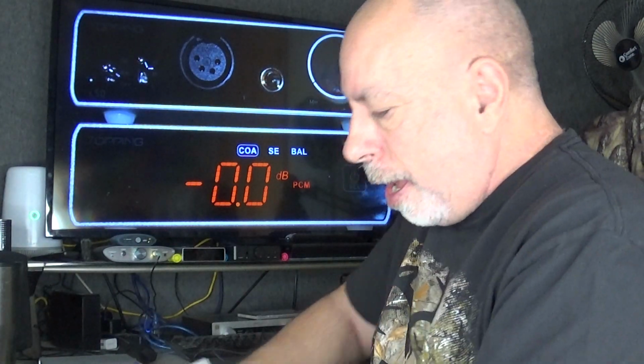So I'm guessing, unless there's some sort of protection circuitry inside of this DAC, if you mix these up, switch them, and plug 15 volts AC into this, which is intended for 5 volts DC, you could do a lot of damage. It's very possible there's protection circuitry in this that will protect it from any damage, but I don't know if there is or not. So anyway, I just wanted to address that. It's a little bit of a concern, and if you do have the two of these, be careful, because like I said, this runs just from a USB power supply, 5 volts DC.